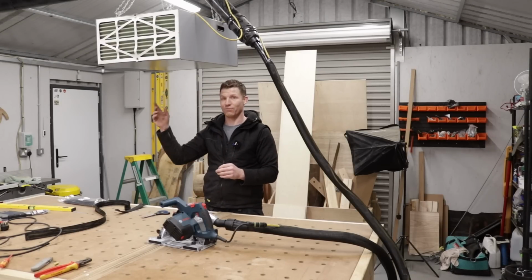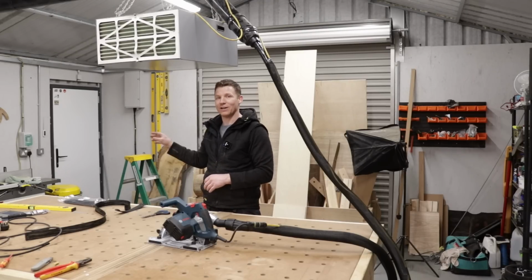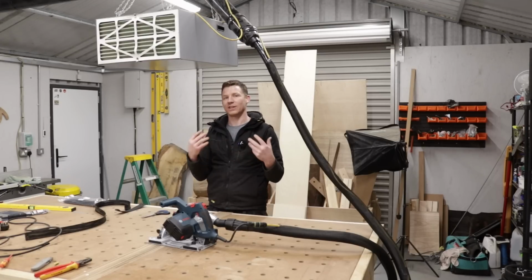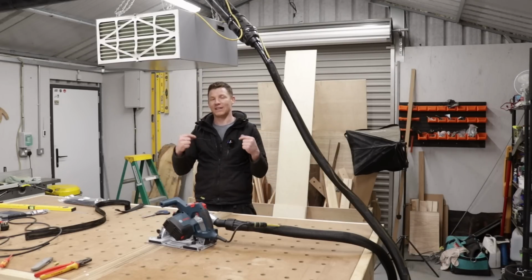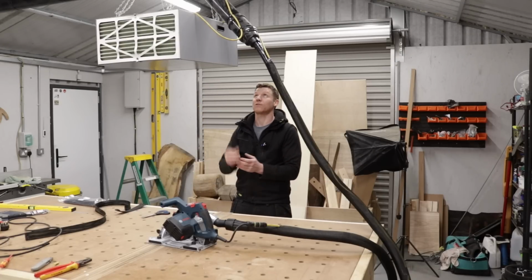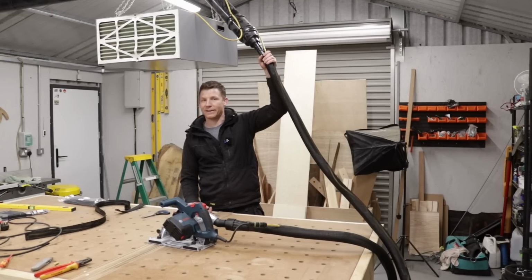And the fact that it's a toughened flex, and the fact that it's going over to the automatic switching socket for my dust extraction, it's actually quite safe in that regard. So it's not like using an extension lead, it's not like using something that's coiled up, it's just a short run over to there, and it's doubled the actual diameter of the original flex. So we're good and it's safe. So that's my setup. Now, something to remember, we need to put our plug on this end.